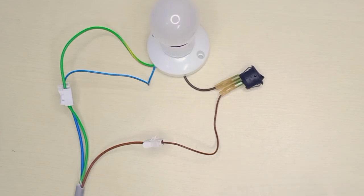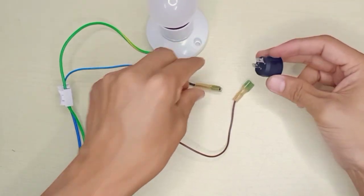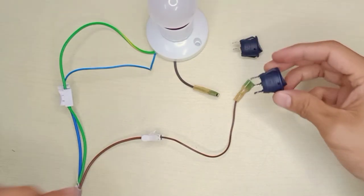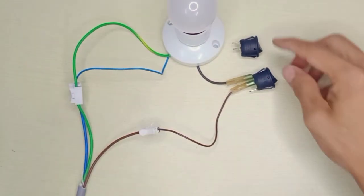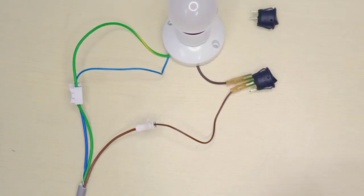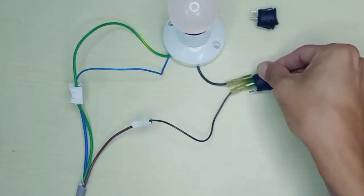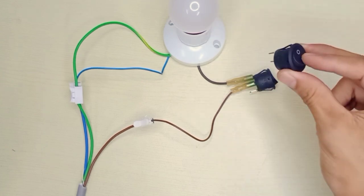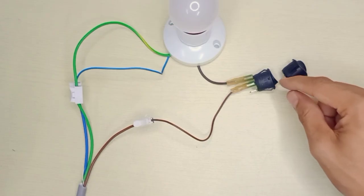I will connect to the middle pin, then turn off the main switch and use the 3-pin switch instead. I'll turn off the main power. This time I'll make it on and off for one light bulb and turn on the main power source — on, off, on, off. If you plan to make it on and off for only one appliance, you can just use a 2-pin. If you don't have a 2-pin switch, you can replace it with a 3-pin — it does not matter, you can still use it for making it on and off.